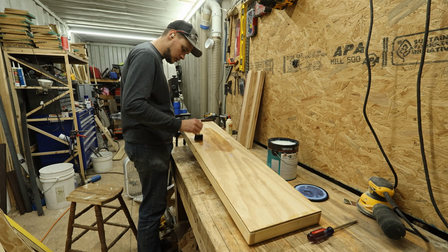And then after that was complete, I forget which side I did first, but I took one of the skins, I put glue over the entire inner structure, and then I put the skin on and brad nailed all the way across. Now, in order to make sure I hit my pieces going across our box, I took my combination square and lined it up with the nail marks on the edge here, because I had nailed in from the sides. So I knew that's where a piece running across was. I put the square across, ran a pencil line, and nailed across there. And did that all the way down, flipped it over, put the other skin on, same exact way. And that was pretty much it as far as construction goes.